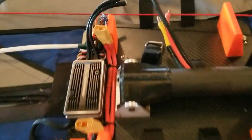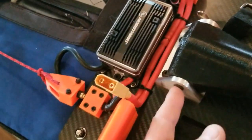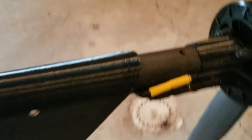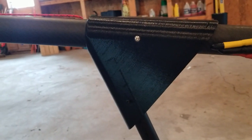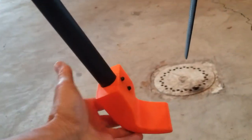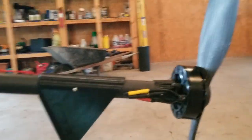I've connected the boom. It's a carbon fiber boom with a 3D printed sleeve. There's a bolt that goes all the way through this piece of aluminum bolted onto the carbon fiber plate. The motor wires run down through the tube and exit here. This is another piece of 3D printed polycarbonate ABS mix, with another carbon fiber tube coming down — just a little piece of ASA 3D printed to keep the tube from sticking. That basically keeps the prop off the ground.